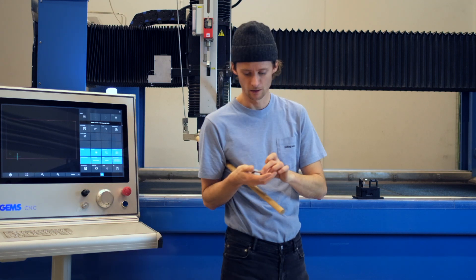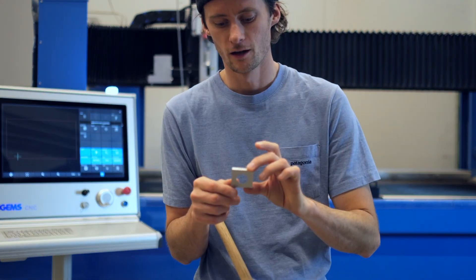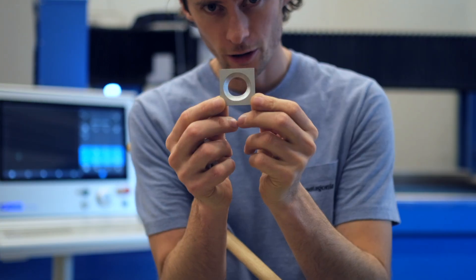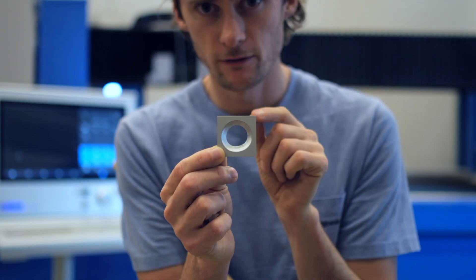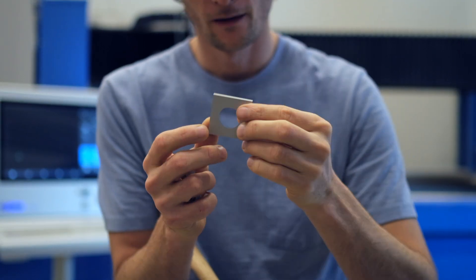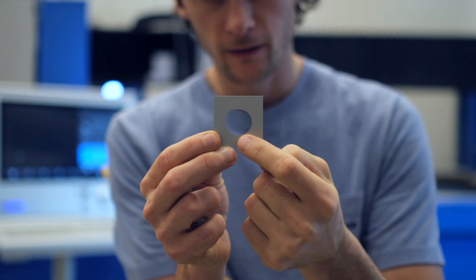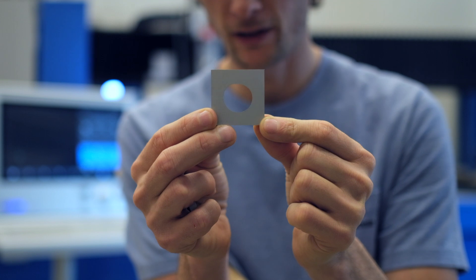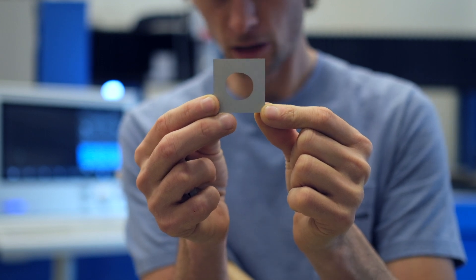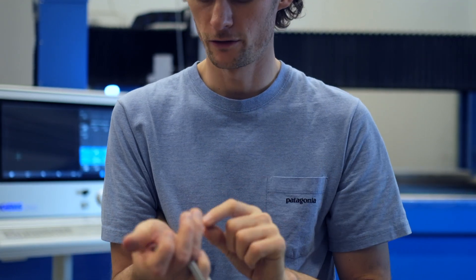You can run a test on your machine to see if your RTCP is off. You make a part like this, which is a circular hole and a 45-degree bevel on it. If you flip it around and look on the back side, you see that this hole is not 100% circular — it's a little bit off. And that means your RTCP is off.